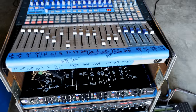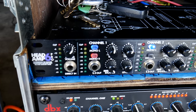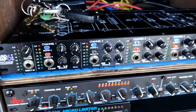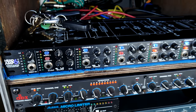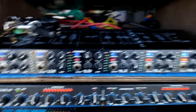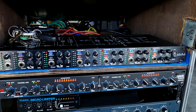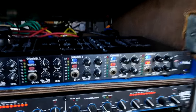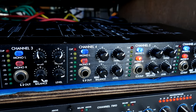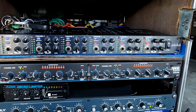The first thing in my rack is the ART headphone amp, and this headphone amp is awesome. I run straight to it from the AUX outs on the board for most everybody, and they're using wired headphones or in-ears — Shures. The different series of Shure in-ear monitors from the very lowest up to the SE500 series. You've got bass, treble, and volume out of there, and they're on basic wire you can get at Radio Shack. It's pretty easy and cheap.